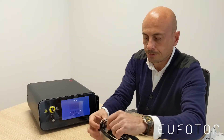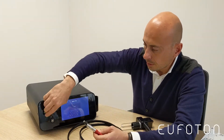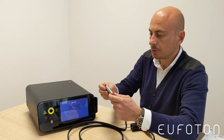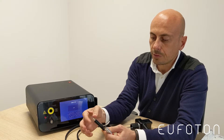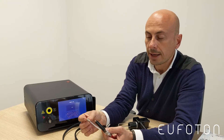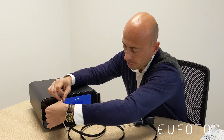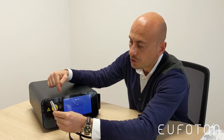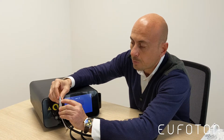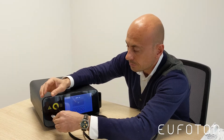We prepare the cable for the connection. Remove the cap — there is a magnet. Remove the cap of the fiber. Remember always to keep the fiber covered while not using. Insert the fiber all the way to the end. We heard the beep: the machine is recognizing the fiber. Be careful about positioning the red dot on the upper side, this way.